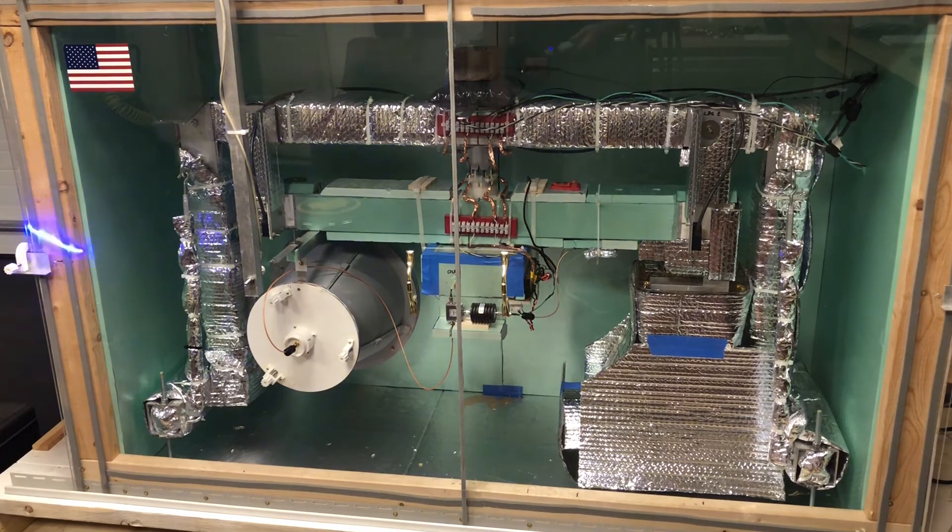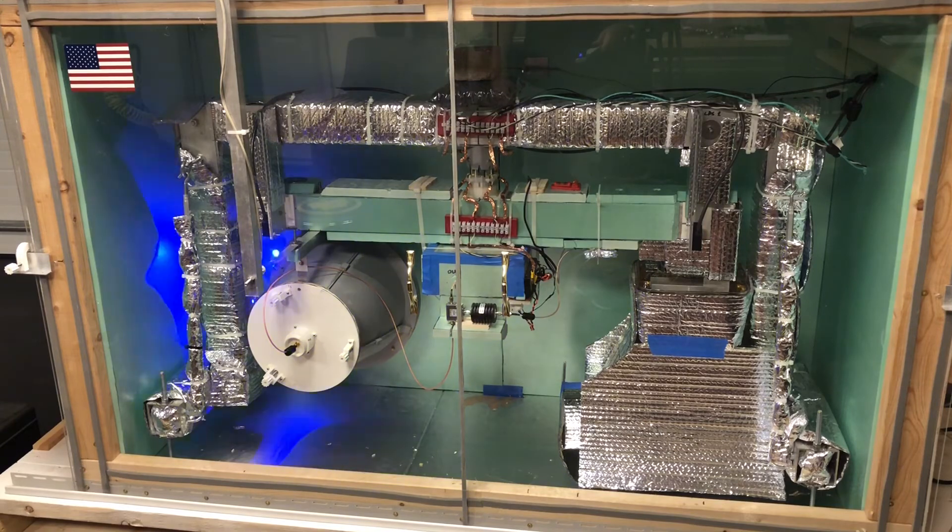Once I put the insulation on, I don't have any more problems. As for the M drive itself, you'll notice these adjustments on the small end. The center one is how I impedance-match the antenna to the cavity — by turning it clockwise or counterclockwise, the antenna moves along the z-axis of the frustum, and that is how impedance is controlled. The three on the perimeter are how the small end is adjusted to be parallel to the large end, which actually increases the amount of return loss you can get.